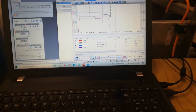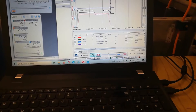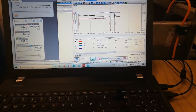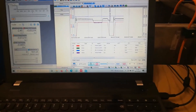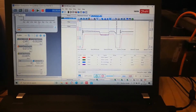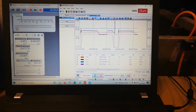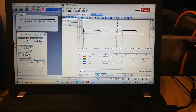We'll start by starting the video with the logging. To start the motor, it's going to run up to 50% of its normal speed. You can see on the graph now that the purple line has restarted and is tracking along — that's the motor current running in. When we start the pump running so that the turbine starts producing power, the purple line has now dropped down below zero, indicating the turbine is actually generating. This is with water as the operating medium.